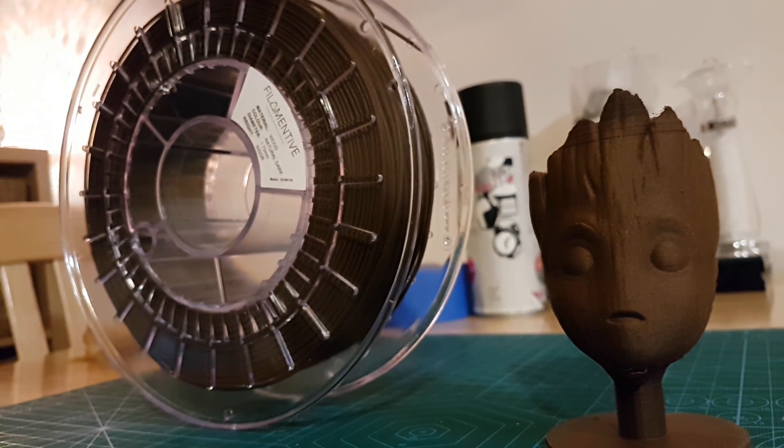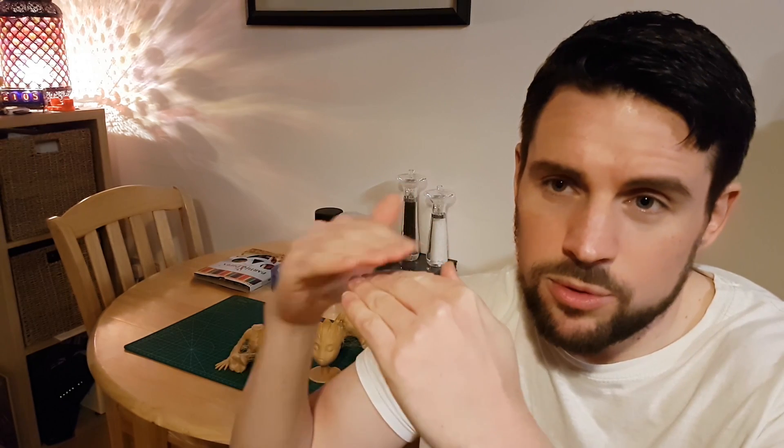I've got another brown wood filament — by Filamentive — and it's quite a new roll so it's a lot drier, and it printed absolutely perfectly fine with retraction. I've had a lot of success with the 3D Primer wood filament, but that was when I was using my Printrbot which has a UBIS hotend — there's no heat break differential between the hot end and the cooling tower. When it does a retraction, there's no immediate hot-and-cold transition; it gradually goes cooler, so retraction was not as problematic.